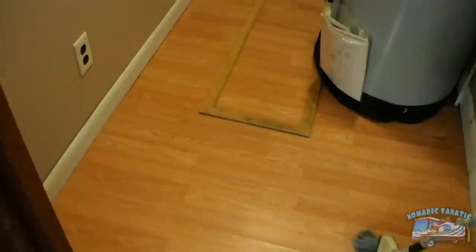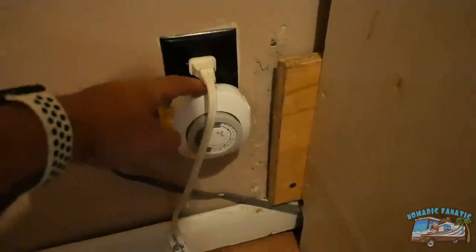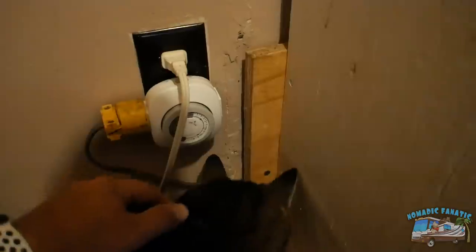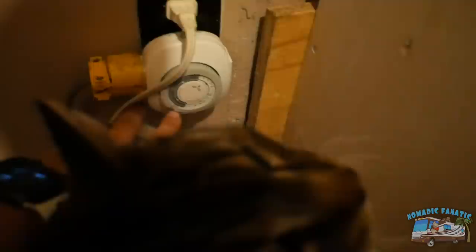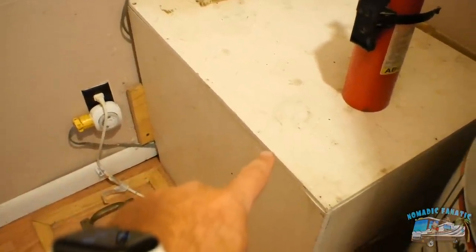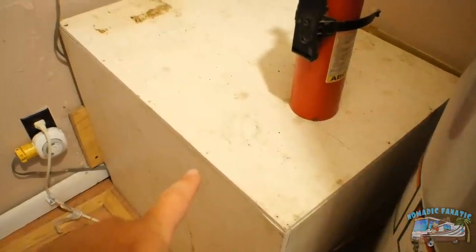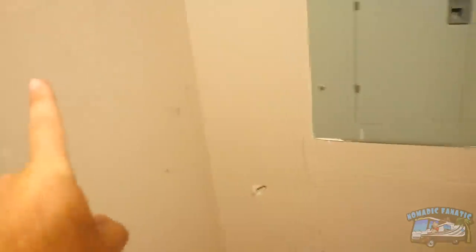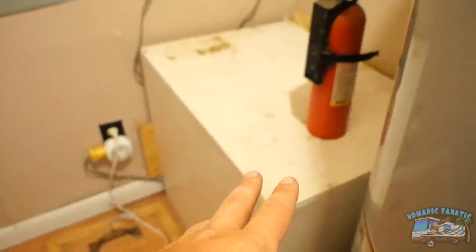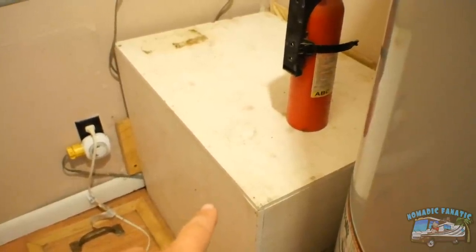I did figure out what's in that box that vibrates. I now have a timer on it — you can see it right there, a little electronic timer clip. It's set to go off for two hours a day. What's in there is not a sump pump like everyone expected — it's actually an aerator pump that goes all the way out to the backyard where my septic tank is and agitates it. It definitely doesn't need to run all day; one hour a day is all it needs to help the sediment and do its job. Even if I didn't run it or the pump went out, it wouldn't do any harm.